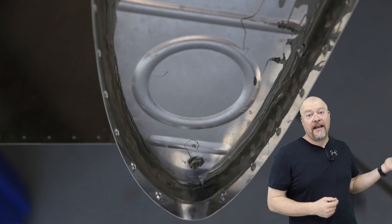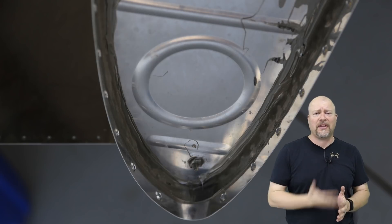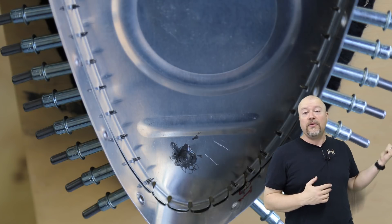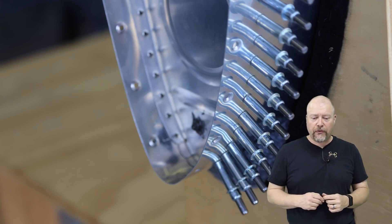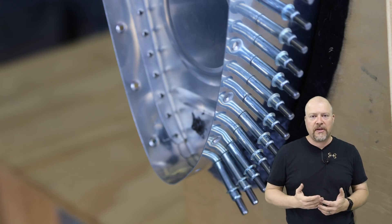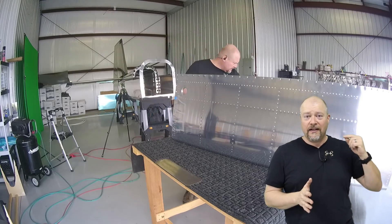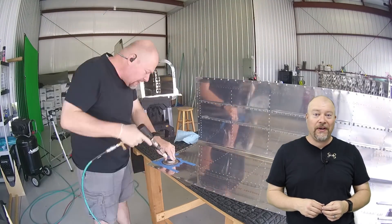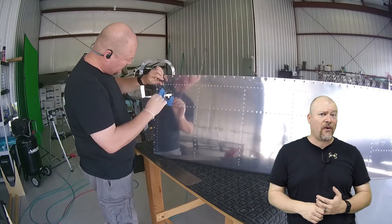You can see in this picture of the other tank, I actually gooped up the crap out of it — I put a lot of that stuff on the outside and on the inside. But it occurs to me that on this particular one, you don't have to put all that goop on the outside because the liquid is on the other side of the metal. You just have to put a nice, healthy bead of ProSeal goop on the inside and not worry about the outside at all.